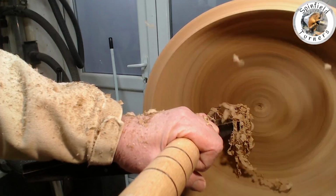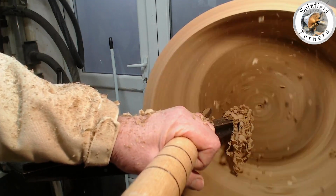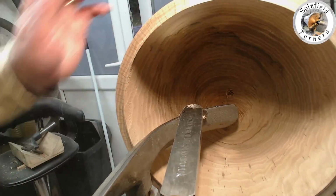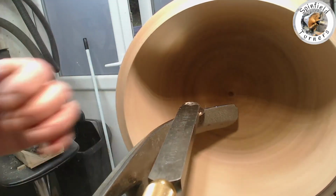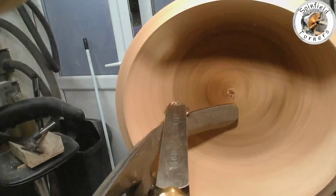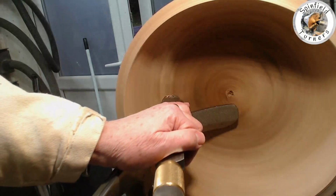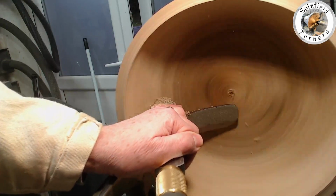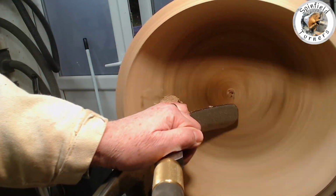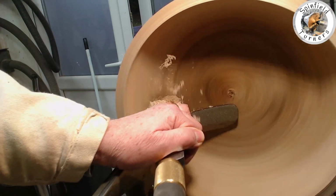And getting some reasonable shavings, some reasonably long, so not too bad. And as the reach got too long, I put on the big old curved tool rest and just try to take out some of the inconsistency at the base with the freshly sharpened Simon Hope sort of negative rake scraper, which produces some relatively nice shavings.